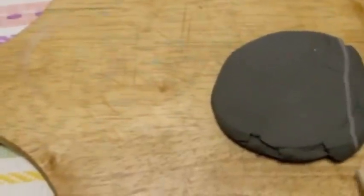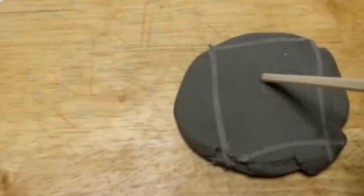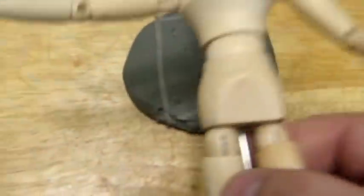Now we're going to move on to the basing technique — how to make the base for a two-half mold. You will need your clay. Here I'm prepping the clay base so only one half of the model is exposed when you do your first half of the silicone. You want a flat smooth surface. Cut all four sides removing excess clay, make sure your lines are nice and straight so when you do your mold box there's no mess. Then replace your model and put the four registration keys at each corner.